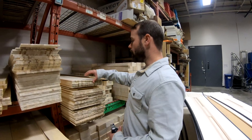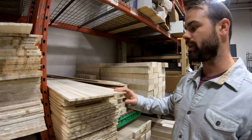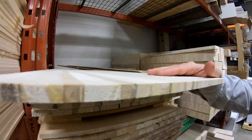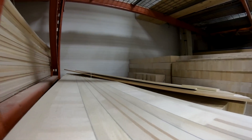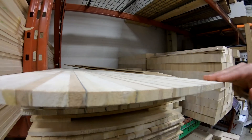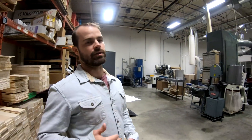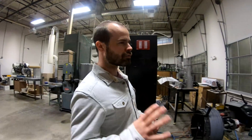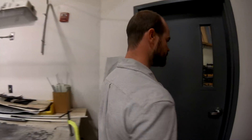One of the coolest things that's come out of being able to make our own cores here is the innovation. We are now producing some cores in-house — these are some prototype cores you're seeing here. We're actually building composites into the wood core of our snowboard. Not only laminating composites on the top and bottom of the core, but we're actually laminating composites into our core. And what that does is give that board a really, really snappy, really energetic ride. You're going to find that kind of innovation on our mystery-level snowboard — some high-end, it's just an amazing ride. The energy that brings to the board is just incredible.